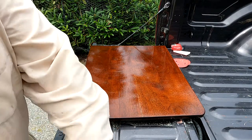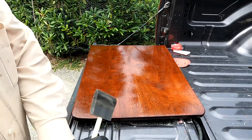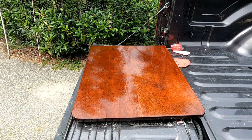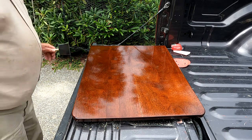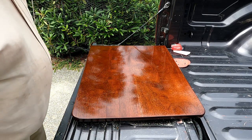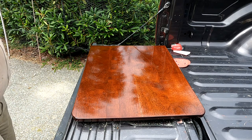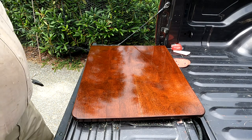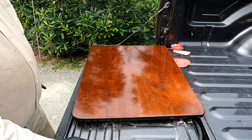It's not perfect by any means. I would never do a finish coat outside like this on a warm, breezy day, because the chance of having it dry unevenly and lose my wet edge would be virtually 100%, and I would get a very uneven coat. The varnish is drying so fast that it's not going to flow out. But this is a build coat — it's going to get sanded fairly aggressively before the next coat. So it's coat number four, and I'm probably going to end up with six or seven coats of gloss varnish before I switch over to the matte finish or satin varnish.